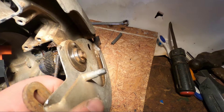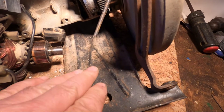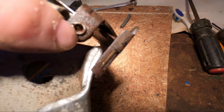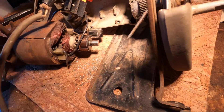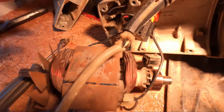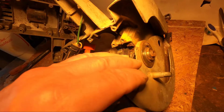To get this gear out, I'm going to pull this piece out — there are two screws over here you couldn't see before with all the sawdust. I'm going to take this off, clean this up, pack it with grease, and put it back in. I was going to take this guide plate off and paint it — after 30 years, it deserves a little paint job. The brushes look like they were in good shape. There's a bearing here. I'm going to get back to taking this apart and packing the grease — nothing exciting to watch. Once I put it together, unless I find something out of the ordinary, I won't be showing the reassembly — it's just putting everything back the way I took it apart.